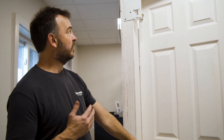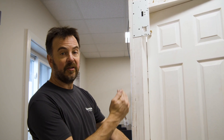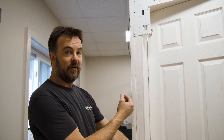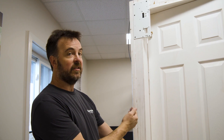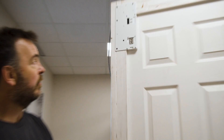The solenoid signal is going to hold for about 10 seconds. I'll tell you when that solenoid signal actually turns off — it just turned off now. And you notice that the latch did not drop. Because of the compact nature of this interlock, once that latch drops, this door cannot close. So it's going to wait — even though it lost the solenoid signal — it's going to wait to latch until the door closes. Once it closes, now the latch comes down.